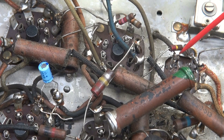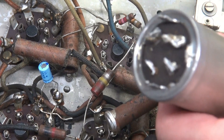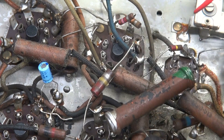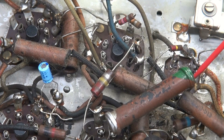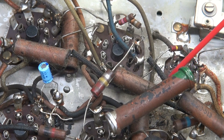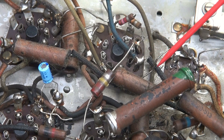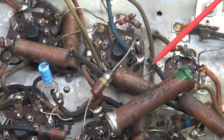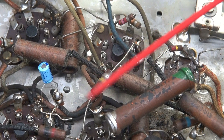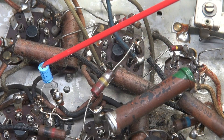Here's the new filter cap installed. This new filter cap has three sections, whereas the old one had four. I elected to use a three-section cap because they are a little less expensive. The fourth section that's not used here was actually a 25 microfarad cap at about 25 volts, and that went to the cathode of the four output tubes, so I decided to use a standalone cap for that.